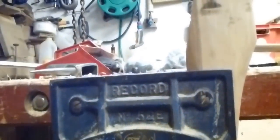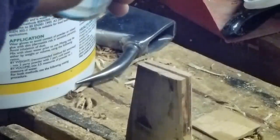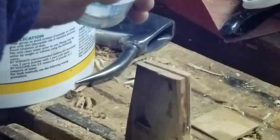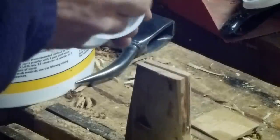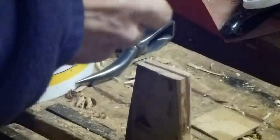I'm using a wooden block on the floor — I've made a small cutout so the handle can sit in it, and I can set the handle in the vise. Now I can really hammer the metal part on and hopefully it won't do any damage to the handle. This handle's been in the living room for a few nights, it's dried right out — it doesn't even register on the moisture meter now. The idea is that it can only get wetter, it'll swell up a little bit and make it a tighter fit. So I'm just mixing some glue for the wedge.